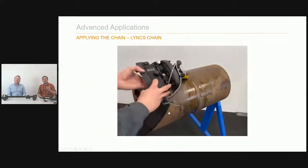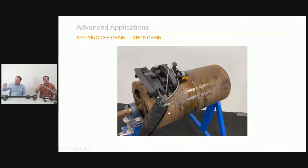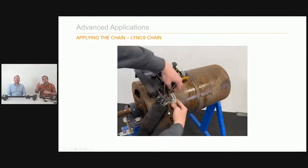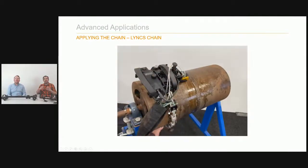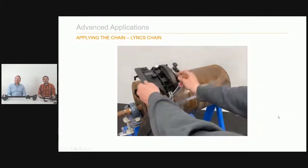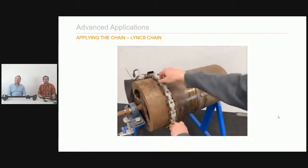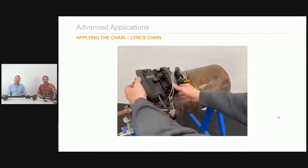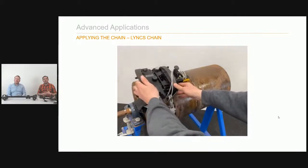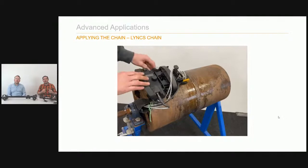In this video, the Links Chain is set up for a single-sided inspection. If you had a raised portion of pipe with a taper, through the complex hinge you could add a probe to the top surface and simultaneously run your scans. It's easy to attach the chain to the Links assembly — there's a quick release on the chain, removable handles for getting around the pipe, and adjustments to set your tension. Once you remove the chain, you can move to a flat plate, so it's not a single-use scanner.